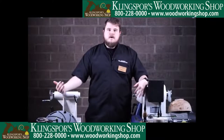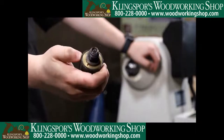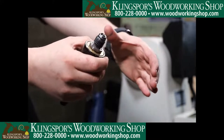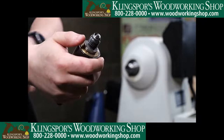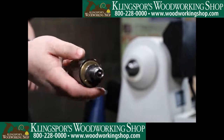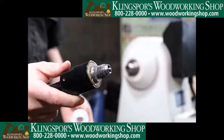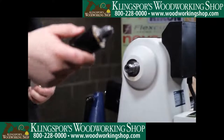We also have some higher-end live centers — say the One Way or Powermatic style. This one has a cone with a center point so you don't split your wood. It also has a threaded pattern so you can stick a big cone on it if you need to center up a hollow form or vessel. They're also double ball bearing, so if you're turning for quite some time you have longevity and the tool won't heat up. They also make faceplates to screw onto this thread pattern so you can hold something big from both sides and have it real secure.